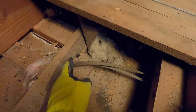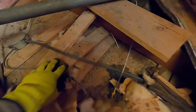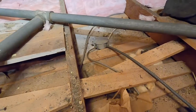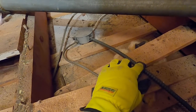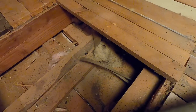I found it right here. Two wires go in here — that's where the plug goes down, and then another wire comes up, and I followed that wire, and that's actually the wire that goes to the junction box. But then this super old wire with metal sheathing goes over here and down over there. What I'm hoping is to completely eliminate this entire junction box, but I'm not sure, because this might be power coming up to feed that outlet down in my office area. I think the thing to do is to go directly under this and see what's down there — I'm guessing an outlet.